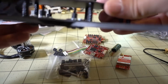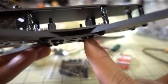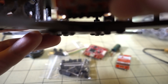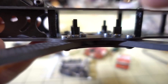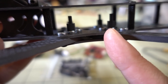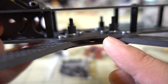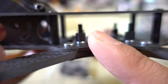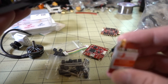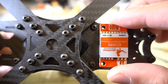Getting this stack in here is going to be interesting because we've got a very limited amount of space — 20 millimeters of height. There's a screw that goes through the middle section into that standoff. If we're going to get two boards in here, I'm probably not going to use that spacer. I'm going to need a long nylon screw and some O-rings and spacers to minimize the distance, because the standard spacers probably won't fit.